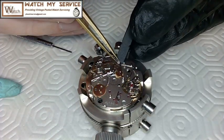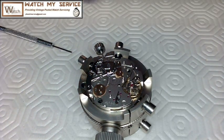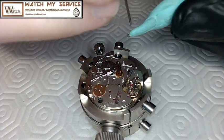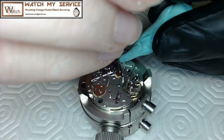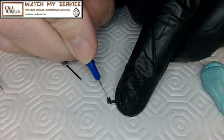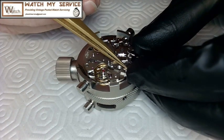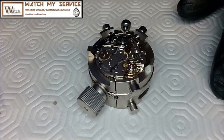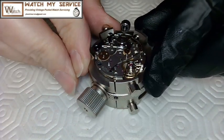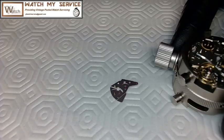This is the operating lever — I oil it appropriately. This lever is pushed by one of the chrono buttons into the cam that works the chronograph function. I screw it in nicely and test it — the chronograph wheel friction part goes in next, which is trickier because it tucks under one plate and onto the other. Then I put on the chronograph bridge, which was tricky because there was already a screw underneath it.